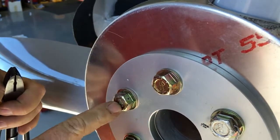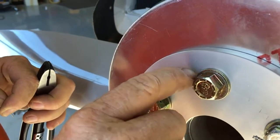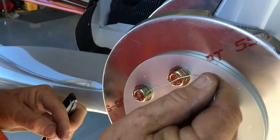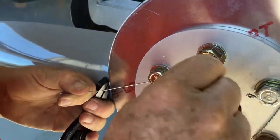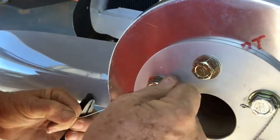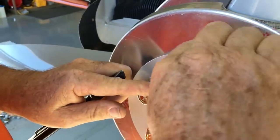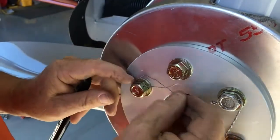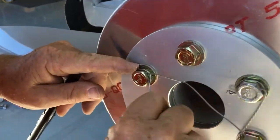So if I'm going to be using this bolt right here, I'm going to take the safety wire and plan to go this way around, through here. I'm going to thread the safety wire through this bolt and leave a little bit extra. I'm going to go this way, bring it around, and make sure I've got plenty of safety wire to get all the way around.